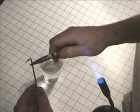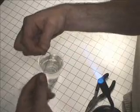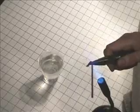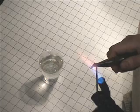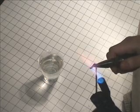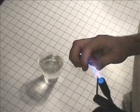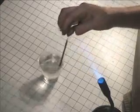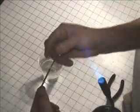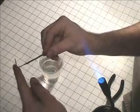which is a 90-degree turn, which gives you a flat spot. Rather than putting it in the lock and having to go on this narrow spot, by twisting it, we'll have a nice, comfortable, flat spot to push on. Do this as close to the head as you can. Always wait for it to be red hot before you turn. So now we do our 90-degree. And dunk. Now we have a perfect 90-degree twist flex wrench. All that needs is to be finished up now.